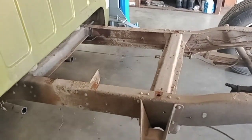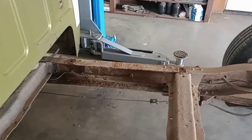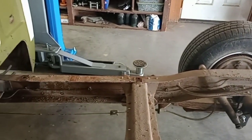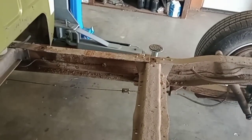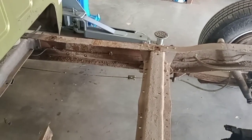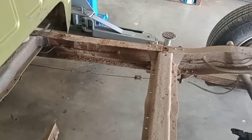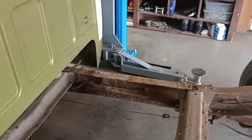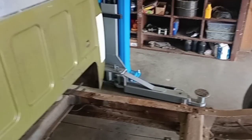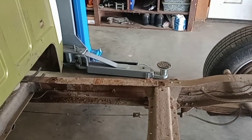You need to remove the four or five bolts down through here for the brake line, then cut the brake lines. Personally I just put a union back in them — a good compression fitting union — and they've always worked fine, or you can buy an aftermarket line. Another thing you'll need to buy on '73 to '87 is a short bed tank; the factory long bed tanks will not work, they're too long after you put your short bed on the truck.